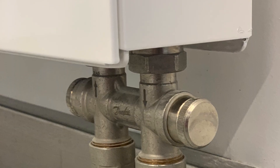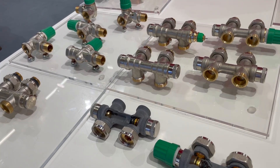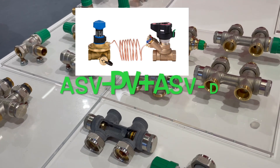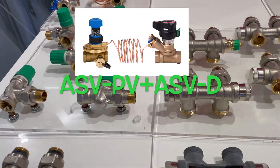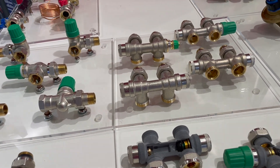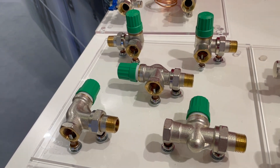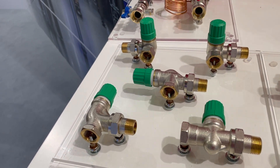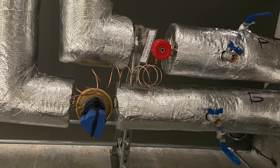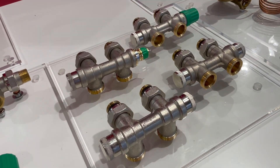In case we have a bigger project and need a bigger pump, you can use ASV PV delta-P controllers for branches or main pipes to reduce delta-P by a maximum of 60 kPa. With larger pressure controllers on the main pipes and branches, a project can be expanded to quite a large one.